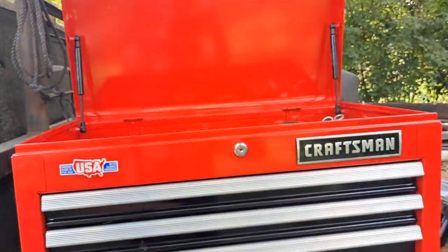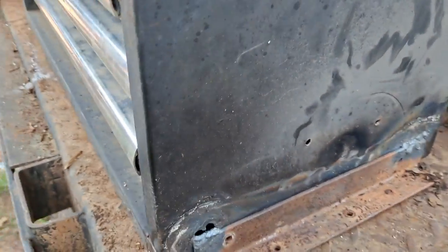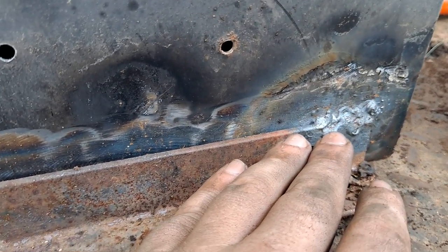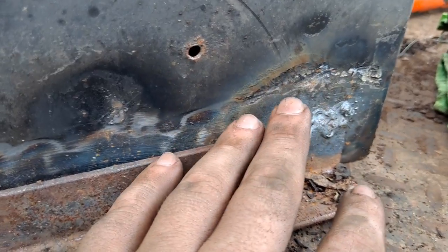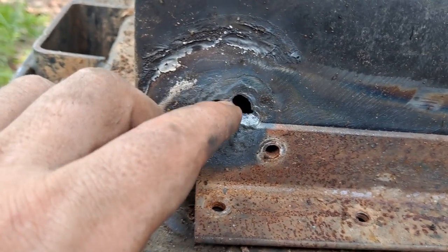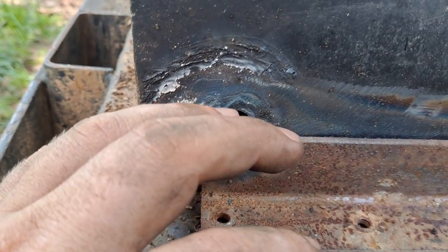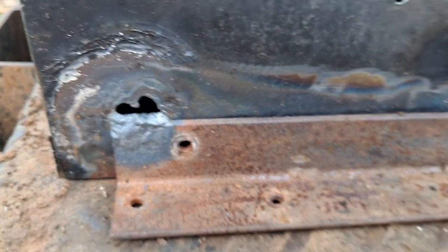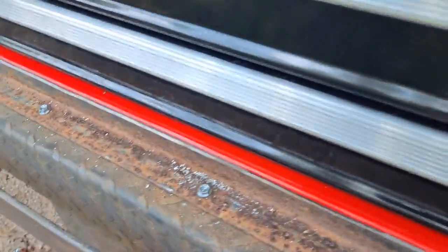I can barely move this thing empty. I was going to attempt something just for fun — I had already bought the new toolbox. I don't have a MIG welder; I do have a TIG welder but I don't have any shielding gas for it. So I tried to oxy-fuel weld it, and you can see — ugly, but it's holding. Ugly with holes in it. There's a difference between holding and holes in it. I know I can fix that hole, but I ain't gonna try it on a brand new toolbox. I said forget it. Even though that would be the cleanest, nicest way — just TIG weld a sweet TIG weld all the way down this. I'm sure if I had the gas it wouldn't blow through.